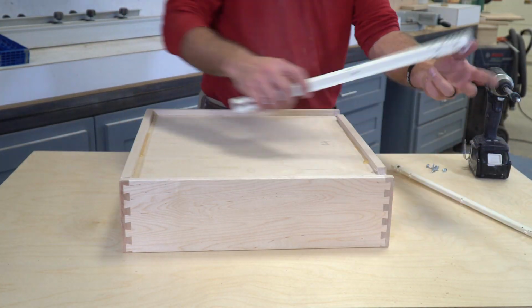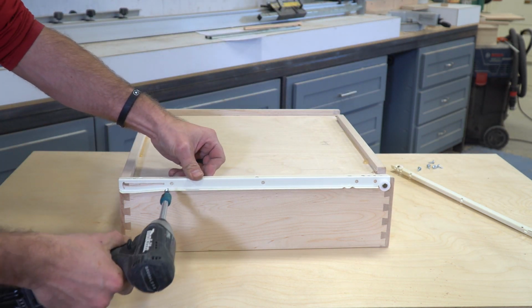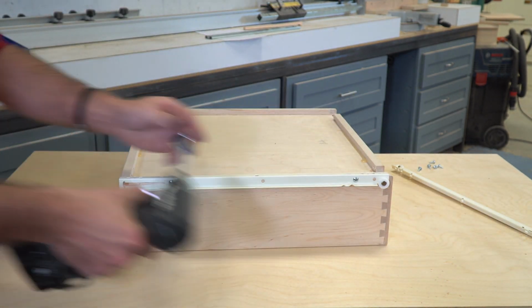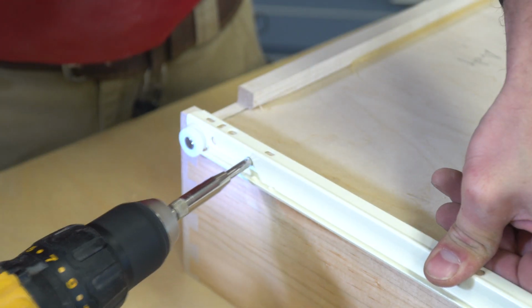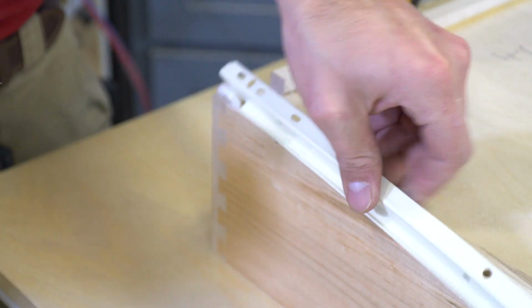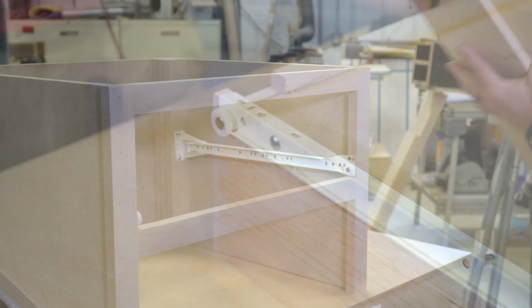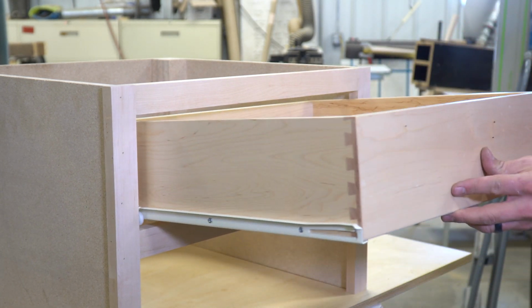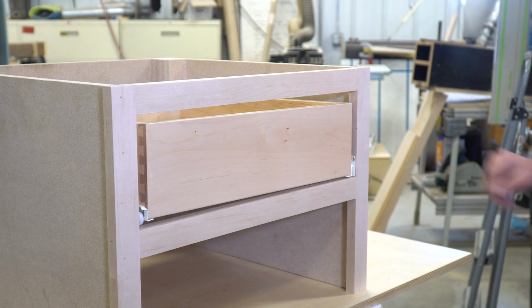Moving on to the drawer itself, use the matching hardware for the drawer, align it to the front edge of the drawer, and then use the screws and mount them to the side of the cabinet. Pro tip, use a self-centering drill bit here as well, just to prevent those sides from splitting, especially if your drawer slide has rabbets, as that is a weak point right there.